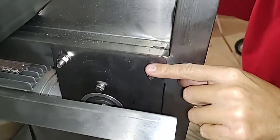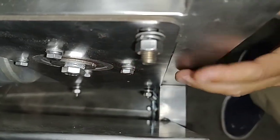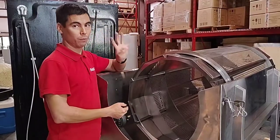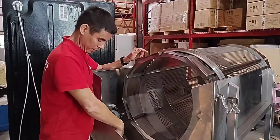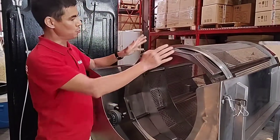One, two, three, and four — that's it. Once you secure all these bolts, you have good tension. When you fix the four nuts from the opposite side of the plate, check the tension again: 4 to 7 millimeters — good. Now you're ready to put the sifter back.